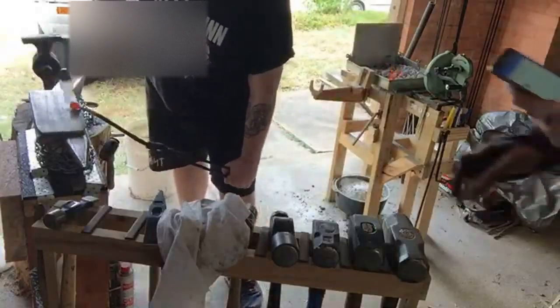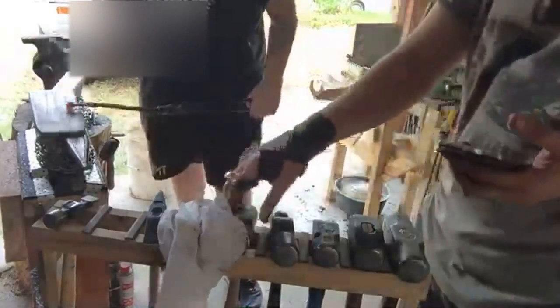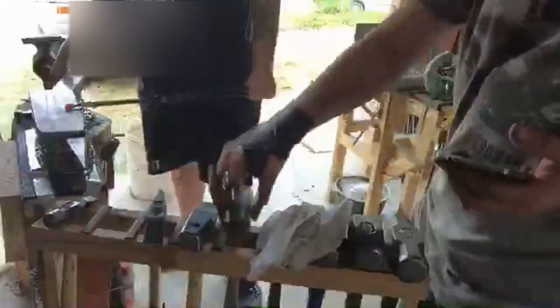If you're going to be flattening it out, you want to switch to a chunkier hammer. Yeah. So, 2.5 pounds, that'll make a man out of you. This has a different side on each face. You want to use a flat one and not the round one. Yep.